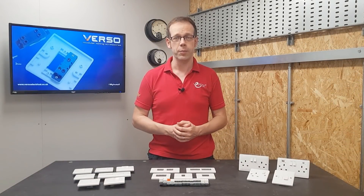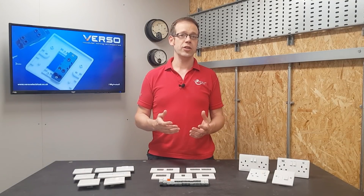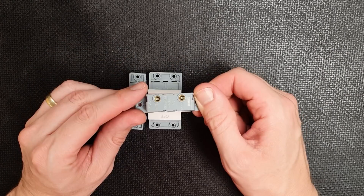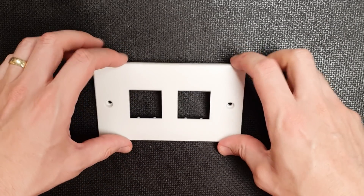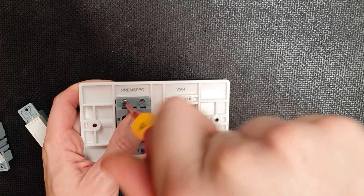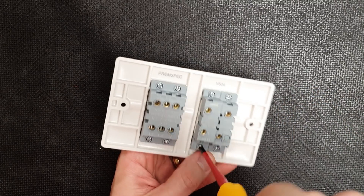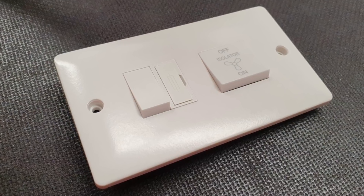Let's bring the camera in and have a look at putting a couple of units together. First of all, we can make up a switching station for a bathroom light and fan. We start by selecting the modules we want and a frame — combining a switch for the light, a fan isolator switch, and a fuse holder to protect the fan — and we'll need a four-gang switch plate. Flipping the plate over, we simply drop the modules into the frame, making sure that the switch is in there the correct way around, and then do up the screws into the back of the plate. Then we do the same for the one-way switch and the fuse holder — simple and quick, and you've got a bespoke fan isolator switch and fuse holder ready to go.